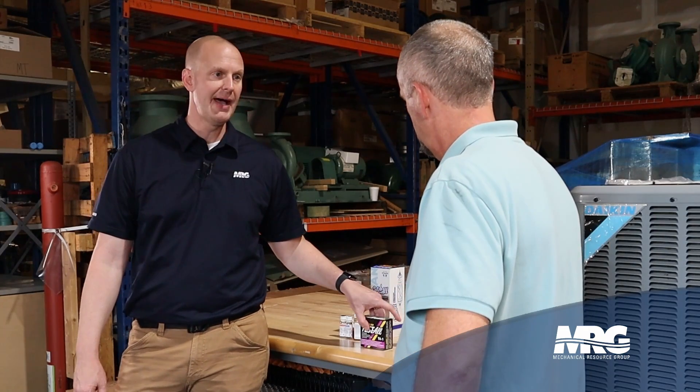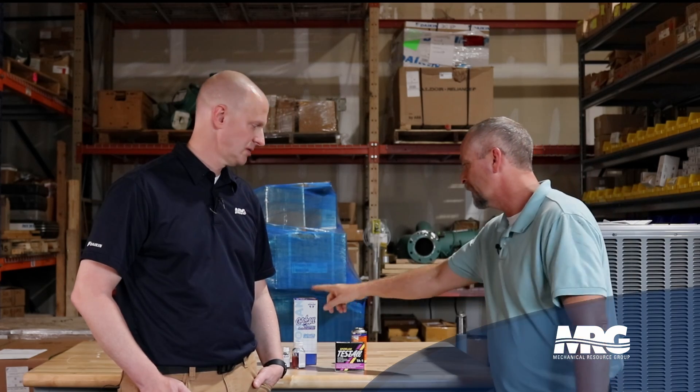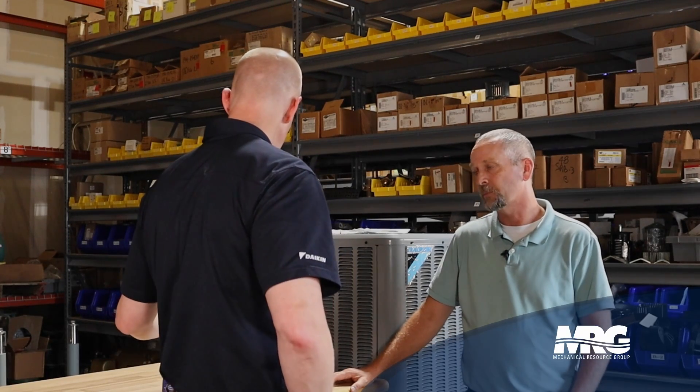You talked about determining how bad the burnout is — does a severe burnout get treated differently than a mild one? I'm using the burnout dryer and acid scavenger regardless of how bad the burn is. But if it's a severe burn, that's when I'd probably also go to a suction line dryer to get that extra level of cleanup. On a larger system, I'll do a core-and-shell dryer and put some valves on it so I can come back in an hour and have those cores out of there. On these smaller systems you have to sweat a dryer in, which means you're going to have to come back and unsweat it. If it's a severe burn, as long as you're communicating with the customer and they understand the scope of work, you should put a suction dryer in.